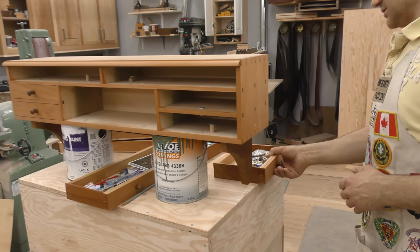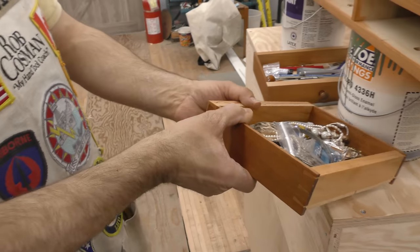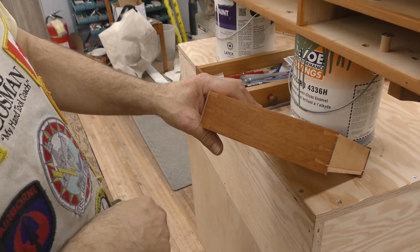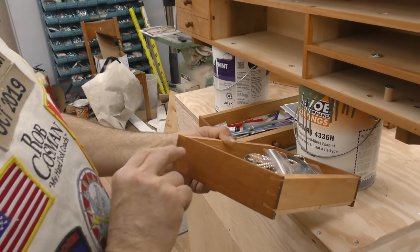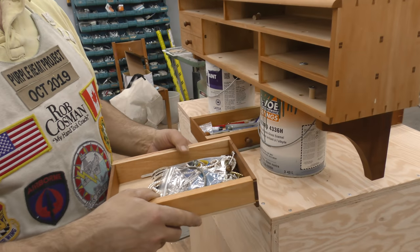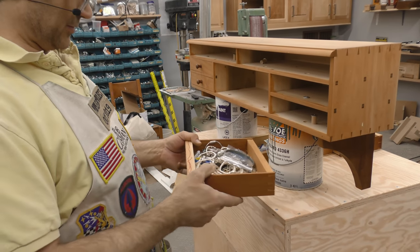Anyway, let's talk about the drawers. Small, thin mahogany — I use mahogany for the contrast, but you've got to be really smart when you do that, and I wasn't. The mahogany and the end of the poplar, when it ages with oil on it, you can barely see that dovetail. I wish I had used a different wood for a little more contrast. Poplar has green in the center, which is the heartwood, and it's white on the outside, called the sapwood. I probably should have used all heartwood — it might have shown up a little bit better.